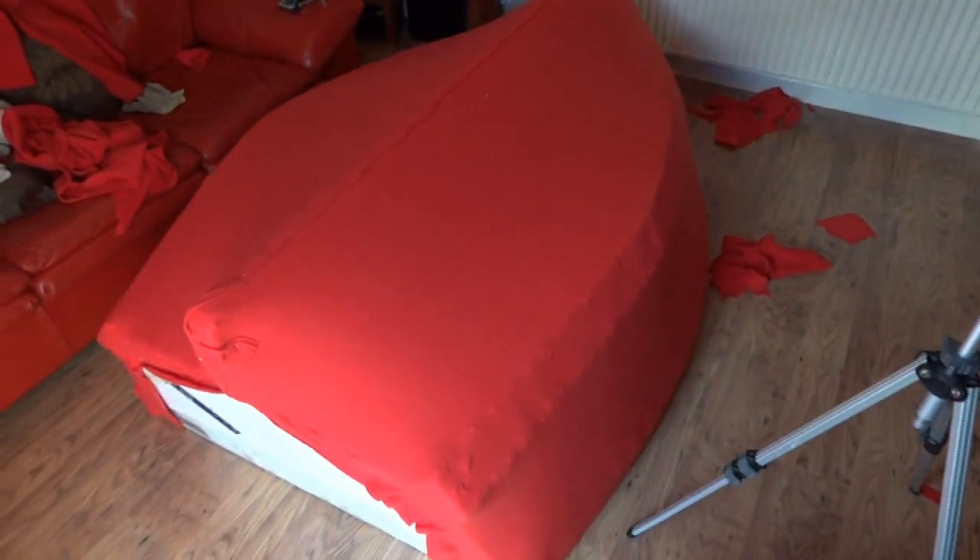There's a bit of a seam right along the keel here — basically I couldn't get fabric wide enough, so there's a join. It's held pretty well, I'm just going to put a few more staples in, but basically we've got the shape of a boat. The next stage is to put fiberglass all over that, as I described before.